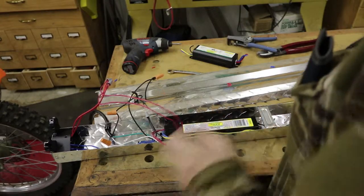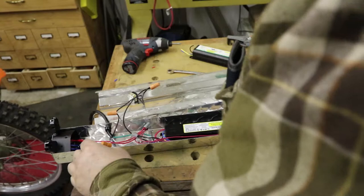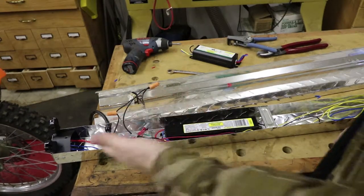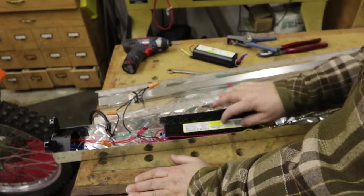So you can see how simple the wiring was — mostly just follow the wiring diagram. On most ballasts I've changed, it's the same setup: typically a blue, a red, and another color — you just match the colors. When we went to buy this ballast, it's harder to find them than it used to be. So it seemed easier to just replace the ballast rather than buying a whole new fixture. The ballasts were about eighteen dollars and a four-foot replacement fixture was also about eighteen dollars, but none of those had reflectors. I hate throwing stuff away when you can fix it instead.